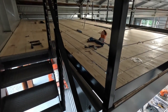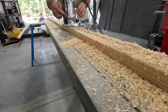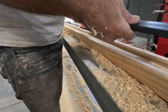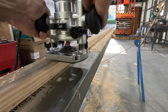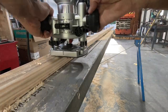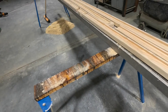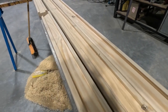This is pretty much all done — the floors, handrails, and cables are all done. Then I start with the actual handrail capping. I looked around and in the end thought I'd just make my own out of pine. I route out the centre to fit the same size flat bar I've used, and that ends up flush. Then I turned it over and used a routing tool to create a nicer radius on the top. Once that was done I gave it a good sand and stained it, just like I did with the window frames and barn door frames. There they are, all routed and ready to fit — really happy with that. It was a much more economical way and I think it's turned out really good.